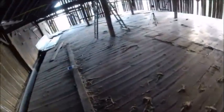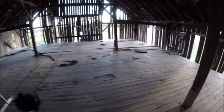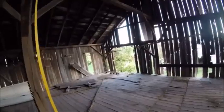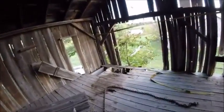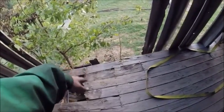Got to work on getting this flooring all out of here. Get it took up, but I'm going to leave it at kind of scaffolding, I think, as I put the bridge crane in. My plan is that I'm going to start on the ends, the posts. So it'll be sitting, let's see, right about here on that row of nails. It'll sit just to the outside, so it's going to sit pretty much right here. So I can cut that out, bring my post up through there, tie that wall in where it'll be braced where it's supposed to be, and it's going to go up almost to the roof, and then it'll shoot across and go under right there where those posts are split now,